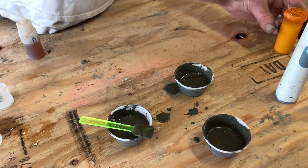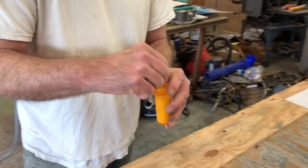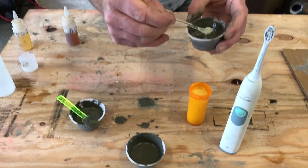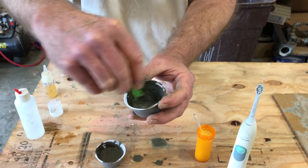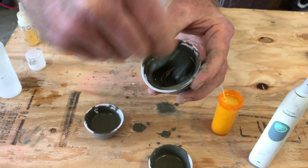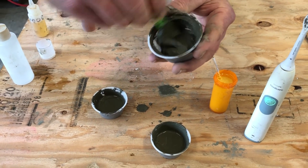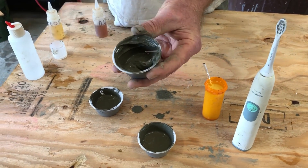So now I'm going to add our 3D admix — this is just a little bit we got in a medicine bottle. I'm gonna do a higher dose than you normally would have in the field because we're all impatient. So this is the effect on regular cement and water. It's not going to happen right away — we want a little bit of a delay so this can continue mixing. This mix is injected into the line of pumped concrete and intermixed in the remaining length of hose, maybe 10 feet.